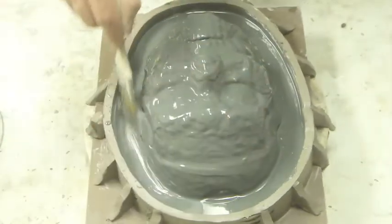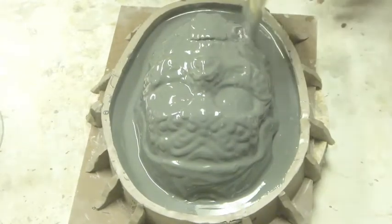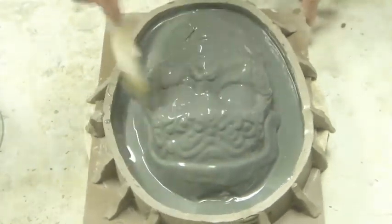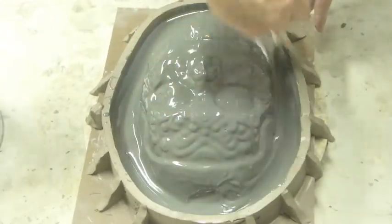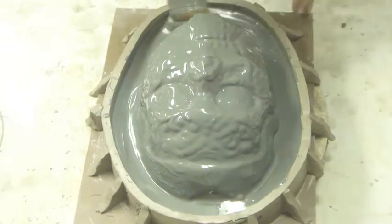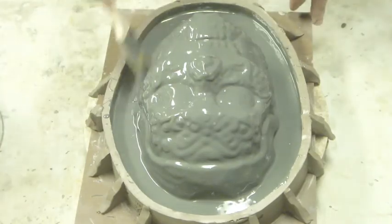And then if you're going to be pulling solid, sort of rigid parts, resins, 1630, plaster, fiberglass parts, then you'll have a soft mold, like a soft urethane, a silicone, latex, something soft, so it won't lock the part in.